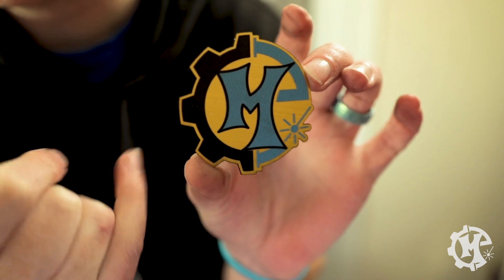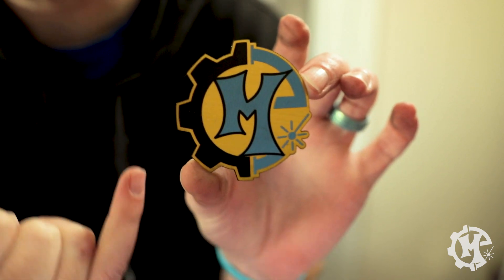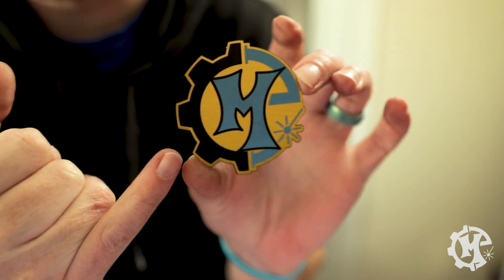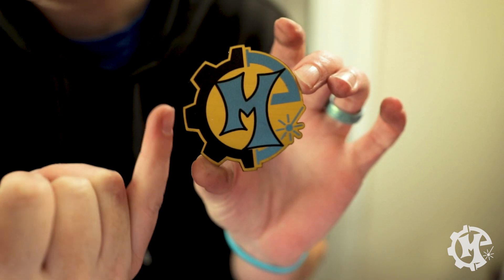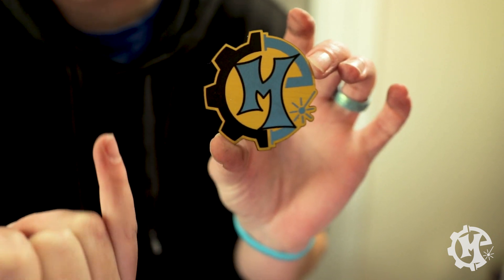I just pulled them all out of the laser. Overall it turned out really well — the print is pretty well centered within the cut. This Laser Mag material does create some residue when it cuts, so you will have to clean it afterwards; usually wiping it down with water works best. That's how you can do print and cut without having any kind of camera. And the best part is that if you have a machine like the Epilogue Fusion Maker or the Epilogue Fusion Edge that don't have those cameras, it does not limit you — you can still do print and cut, which is pretty awesome.